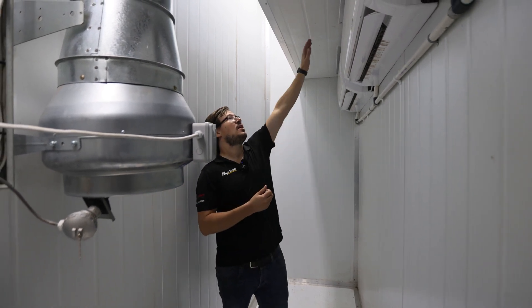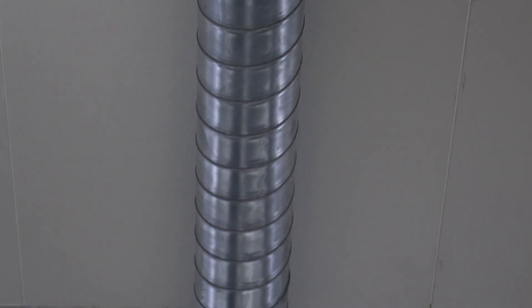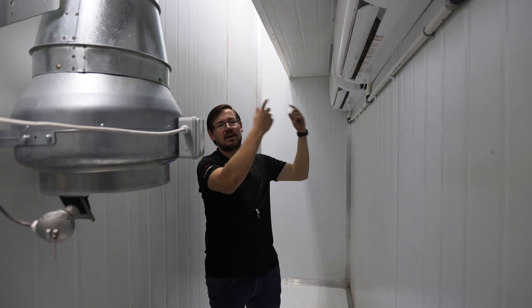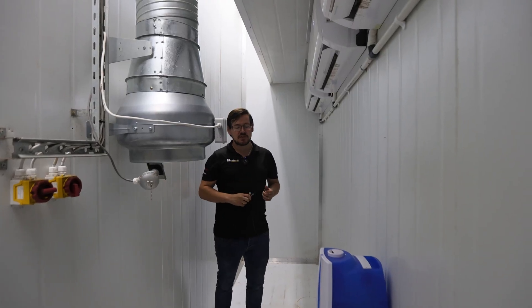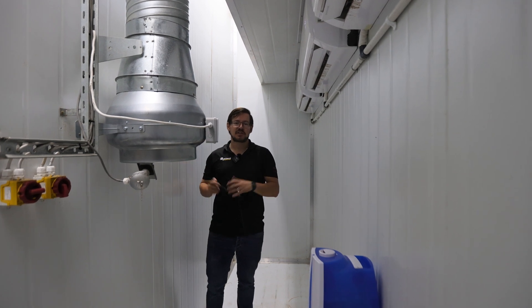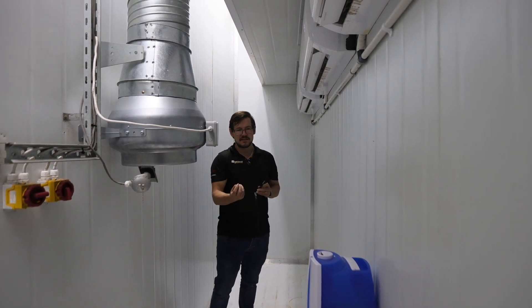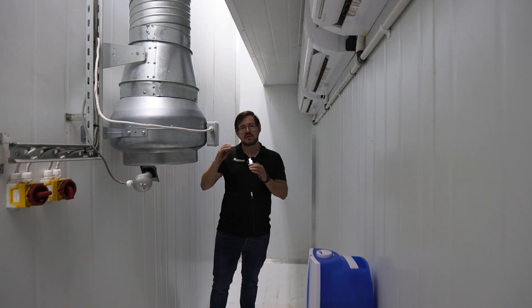How this room works is hotter air enters the top of the air conditioners, cold air comes off of them and gets blown through this duct tin into the cool store. We measure the temperature and humidity of the air returning to the system — if it's too hot or too humid, we tell the air conditioners to turn on. We also have a humidifier, because occasionally this room could become too dry, causing the nuts to over-dry. In South Africa we want the nuts dried down to about 8%, not further. In winter conditions the room could be too dry, so the humidifier turns on to wet the air very slightly — about a teaspoon of water every hour — just to bring humidity back to acceptable levels.